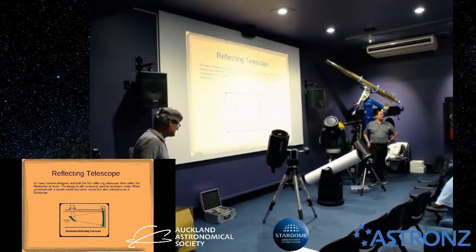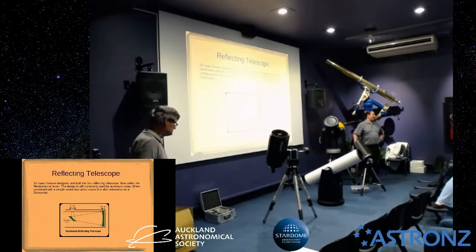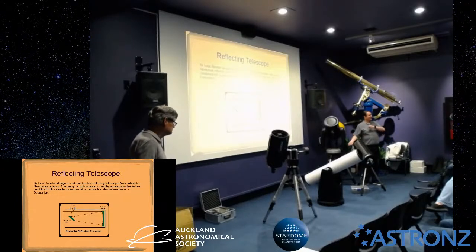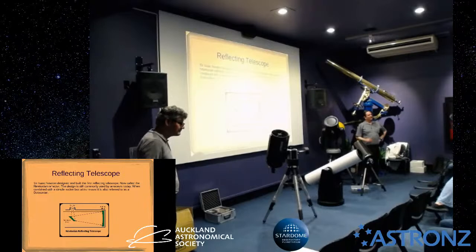If you've got a Newtonian scope, it is worth owning one, because particularly if you take it anywhere, the biggest thing that knocks a scope like that out of collimation is throwing it in your car and getting it out. So if I take an 8-inch Dob anywhere, the first thing I do after I get out of the car is fire the laser in, click, click, yeah, we're good, we haven't moved it much in transit, and then you've just got a better imaging session. Especially if they're bigger than 8-inch, I see that the mirrors do move on their boards. And it's the primaries that normally go out of collimation first, just because there's more mass there.